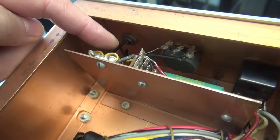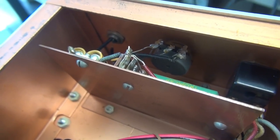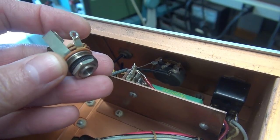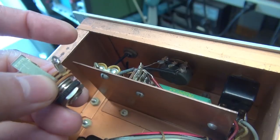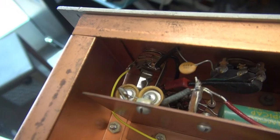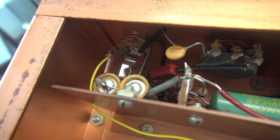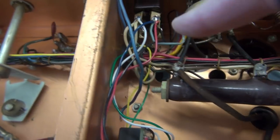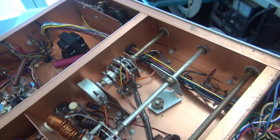It's time to change out the mic jack itself. You can see it's buried down in a hole — not very accessible. If you imagine putting in a four-pin mic jack and having to drill that and mount it, it would be a real challenge. So to make it easy we're going to put in one of these TRS mic jacks — this is a quarter-inch headphone style. It'll drop right into the existing hole with no drilling required and the wiring is a piece of cake because it's got these big lugs staring at you. There's the new mic jack installed — just barely makes it in there. So the PTT wire comes out, goes across the wire harness, swings around and hits the board. It's all wired up — I'm going to give it a quick look over, make sure it's safe to operate, and we're going to test it.